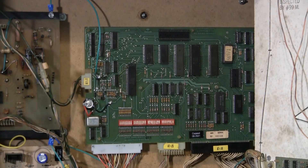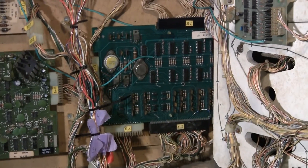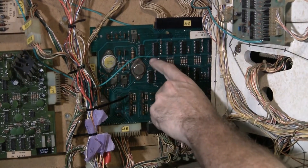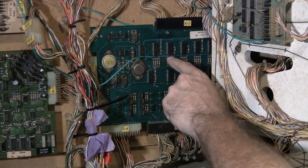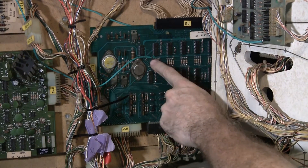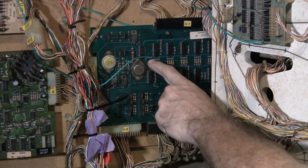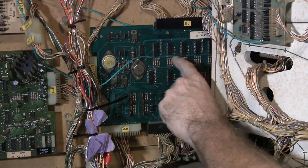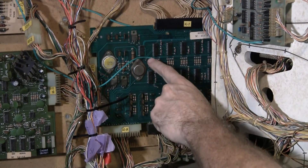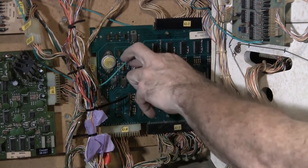If we go clockwise to the power driver board, we're tying in on this logic ground plane right here. You basically burnish off a little bit of the coating and tie into this thick plane between these resistors and these chips up here. Then that just goes up into the ground plane — that's the ground mod for this one.